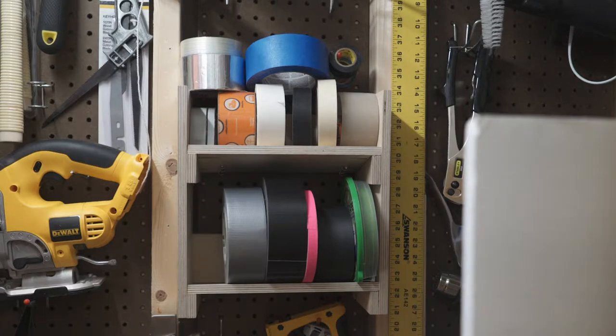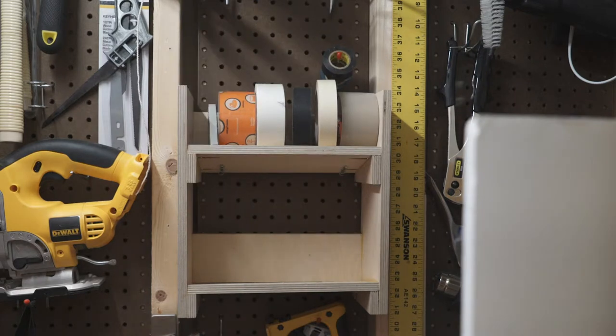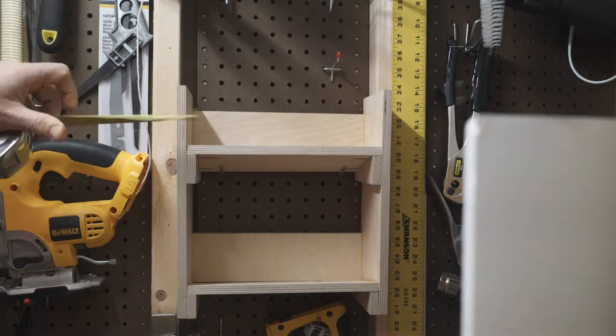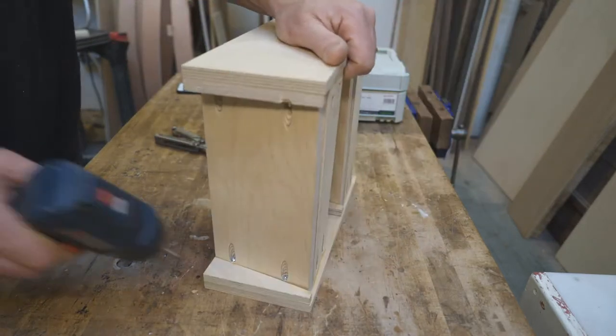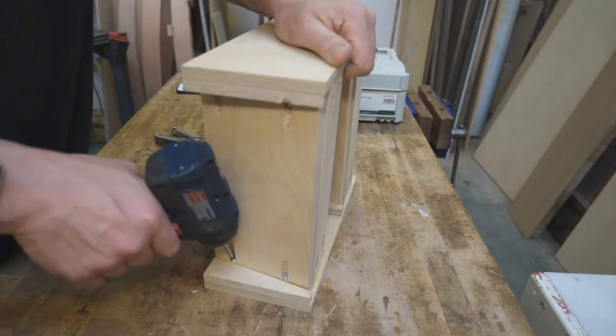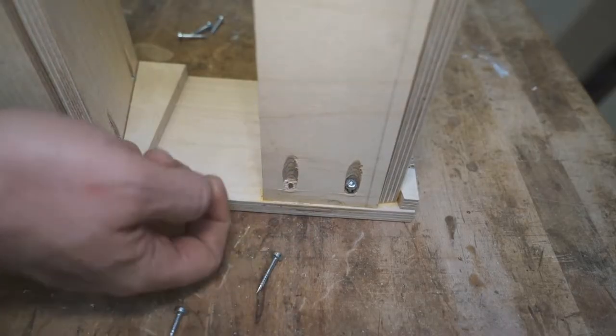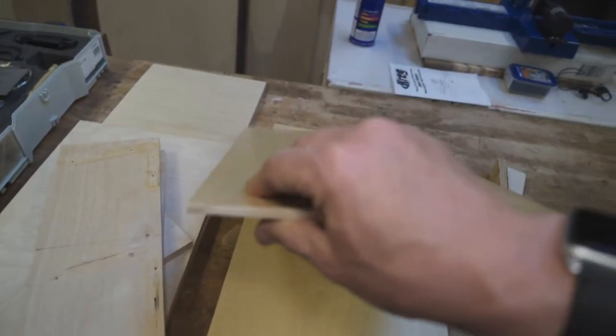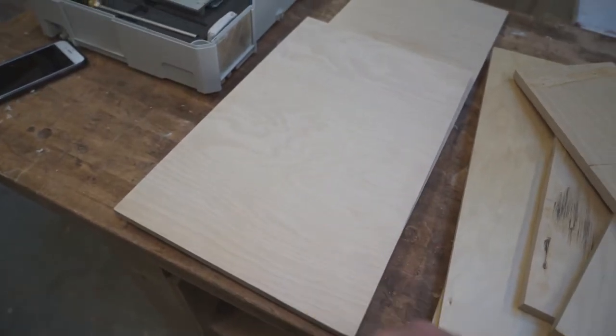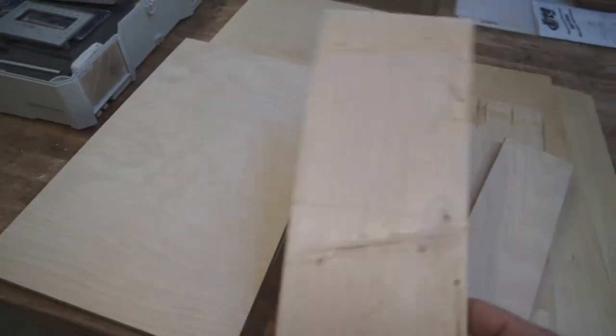I work at a shared wood shop in Brooklyn. The first thing I did was break apart the old one to see what I could salvage. The glue kind of tore up the wood so I couldn't use as much as I'd hoped. I'm going to use quarter-inch material left over from some drawers I built to make the two sides and the shelves. The backs and wedges will be made out of half-inch plywood to add some stability, and also because that's what I can cannibalize from the old rack.